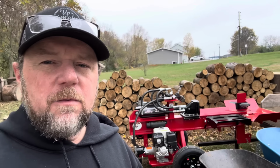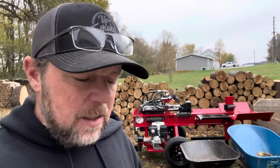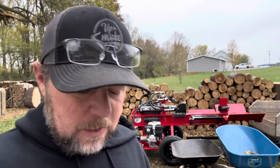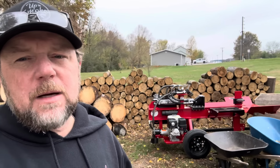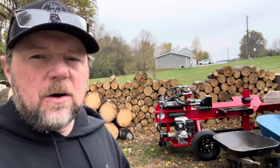But this is what I'm excited about with this 22 RS. Very fast cycle time, just over 6 seconds. If I go down to a single knife there, I think I'm going to be able to emulate what I was doing with the 17 VSC with this, just in a horizontal position, because of the fast cycle time, a little bit smaller footprint splitter, and I could really stand over that wedge and get a good view of what I'm doing, making kindling and bundle grade wood, because we do a lot of it. There you go again. This is why Wolfe Ridge and other manufacturers make so many different types of splitters, because everyone's needs aren't the same.